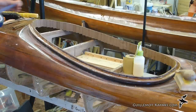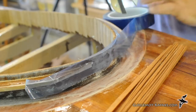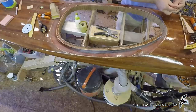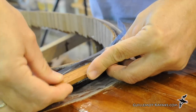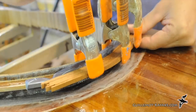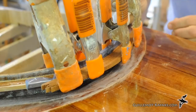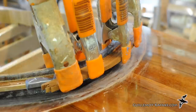Like the rest of the lip, I want to laminate up the front bit in place, remove it, clean it up, then do the final installation. This starts with some flash tape to keep the glue from sticking. I have a bundle of short thin mahogany strips that will stack up, clamp in place, then glue. Instead of epoxy, this time I am using a very low viscosity CA glue that I hope will soak down between the layers and glue them solidly together. The whole combing will eventually get another layer of glass and epoxy — I just need something strong enough to hold it together until then.